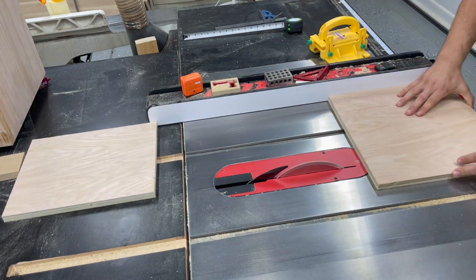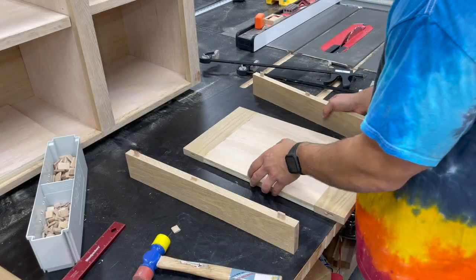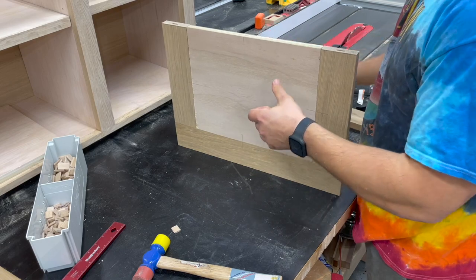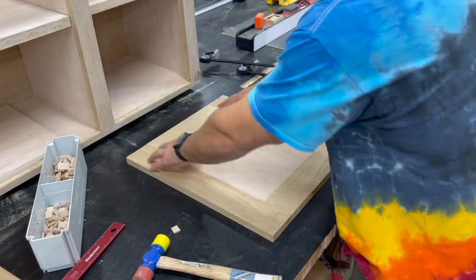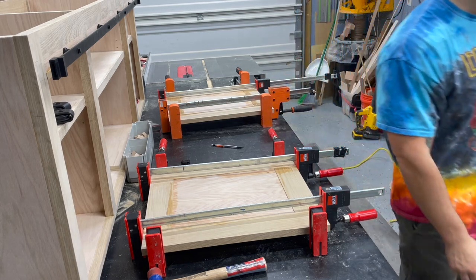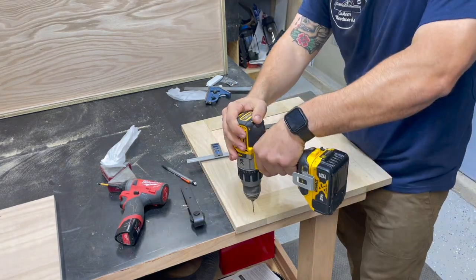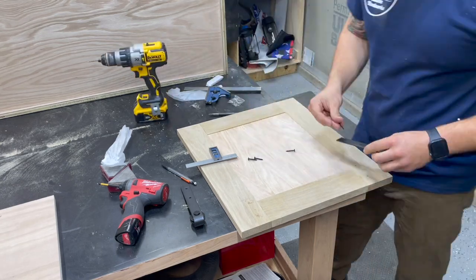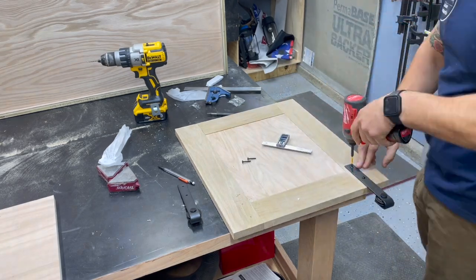Since both doors are the exact same size, once I have one dialed in I can go ahead and make that second cut. I tacked the doors together, cut out some dominoes — same process as before, so I'll save you from watching that footage again — then went straight into the glue-up. The camera died during the glue-up, but as you can see everything got glued up and clamped. I then figured out exactly where I wanted the sliding door hardware to land, took measurements off camera, set my squares so I could easily trace the lines, used the hardware itself to mark the holes, pre-drilled, and locked everything into place.